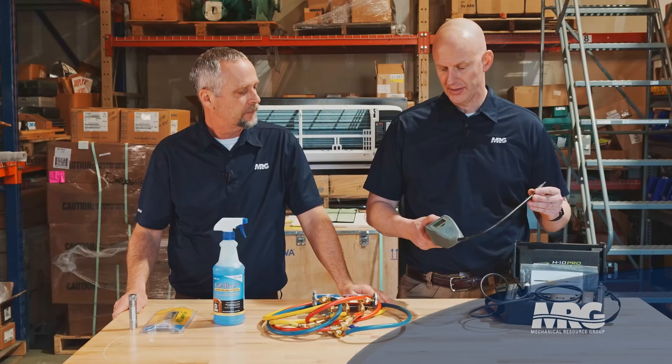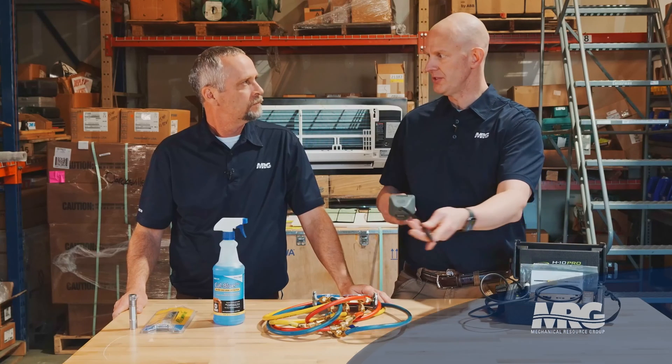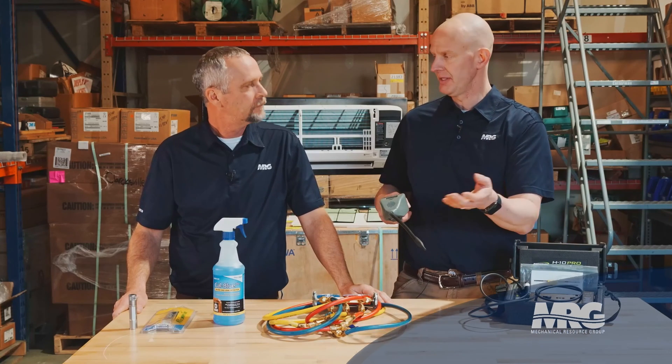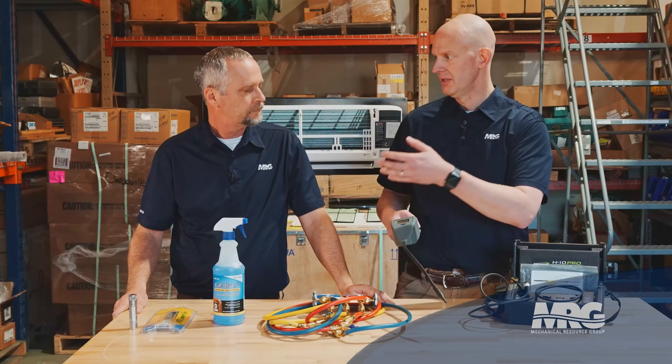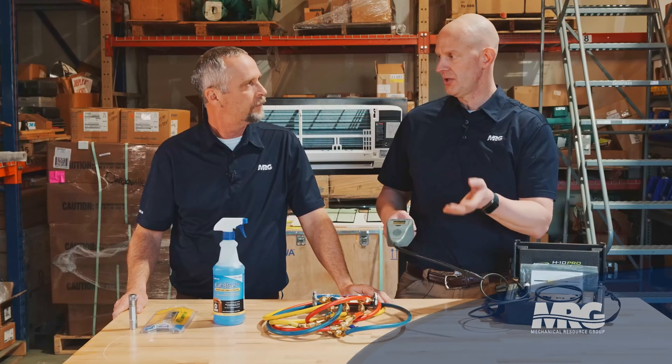There are lots of different brands out there. A lot of these are rechargeable or take replaceable AA batteries, with a flexible wand which is nice and handy. You take this sniffer along the refrigerant circuit, starting maybe on the evaporator coil, working all the way down to the compressor, then working back up on the high-pressure side. The LED display has a little bar graph that goes up and down as it starts ringing out, and the beep gets more rapid as you get closer. As you pinpoint the leak, you'd see the bar graph go all the way up.